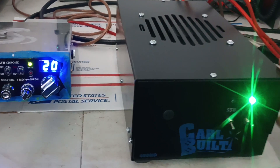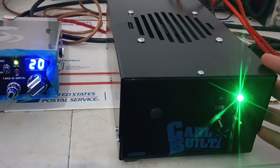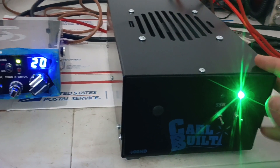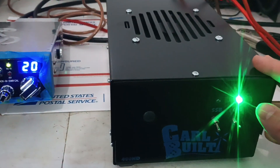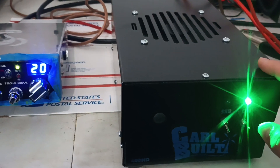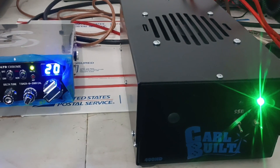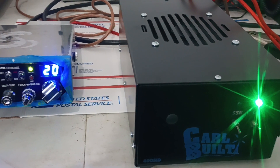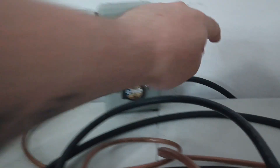Now as far as toughness and longevity, the C box is going to give you a lot more headroom, but it's all in what you're looking for. With the same amount of drive — 100 watts PEP going in, 40 watts average — one of these will do more. But there again, the 4-pill C leaves you some headroom and you can always get more power out of it if you have like a couple hundred watt radio.